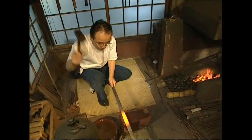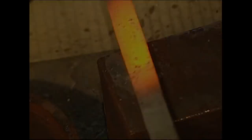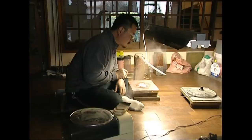The apprentice's work is complete and it's time for the master to craft the blade. With so many layers of pure steel, it's incredibly strong and it takes him days to knock it into shape. After the master has finished shaping the steel, it's painted with clay. This isn't just to give it an ornate pattern — when it goes back in the furnace, the clay will cause different temperatures to build up on parts of the blade, making some parts softer and more flexible.